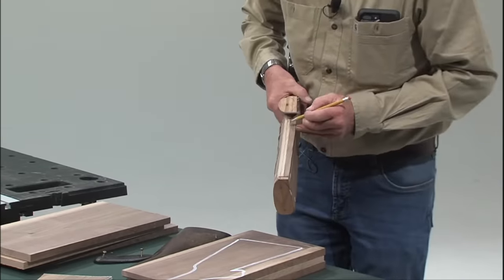On the edge, I can do the same thing with my guidelines — use my pencil and my finger and run it down like this. I've got my center, the high point, and the very edge as my other point. Then I'll run another center line to establish the drop-off point for the trough that I'm going to cut with a chisel, to establish part of the shaping of the pistol grip area of the stock.